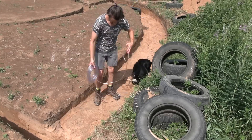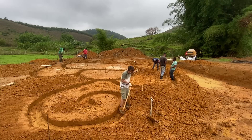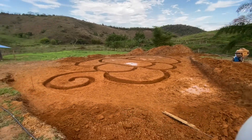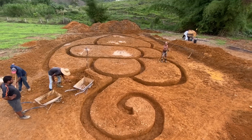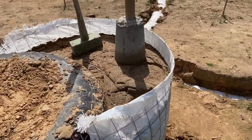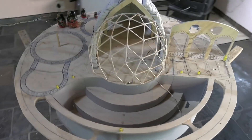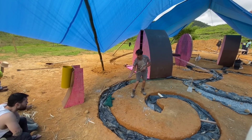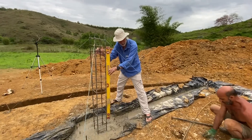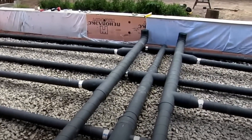I will show you how to prepare the ground and how to dig a level foundation using a water level and simple tools. You will see how to dig in sandy soils as well as hardcore clays using basic shovels and hoes. To explain the construction of the foundation I will teach using my Brazilian build, my Siberian build, as well as the one on my own land in cold climate. In the theory class I will explain the necessary alterations required for various soil types, water table levels and climatic conditions — for example waterproofing to avoid the wicking of moisture up the walls, as well as insulation to stop frozen clay from lifting up your home.